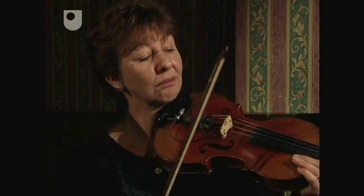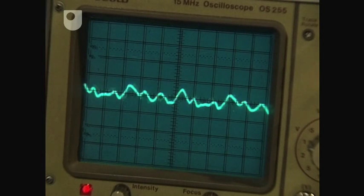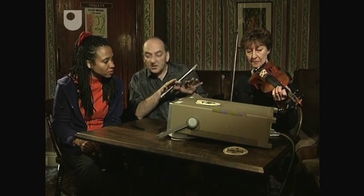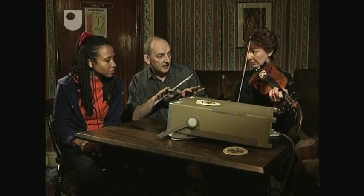If Sheila would play A on the fiddle. It's very different, isn't it? It's a lot messier — really all over the place. You can just about see the sine curve underneath, but the string on a violin, when stroked with a bow, produces a lot of secondary notes called harmonics, and that accounts for the very complicated pattern it produces on the oscilloscope.